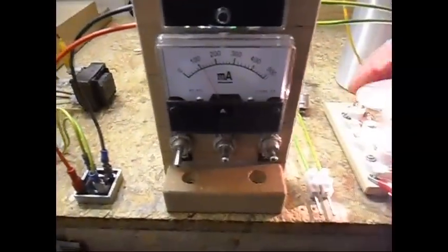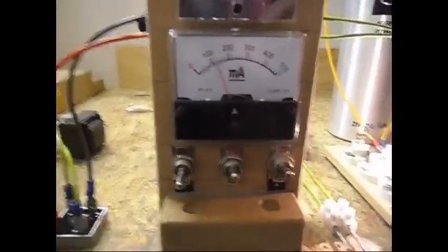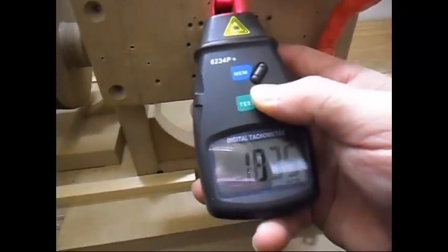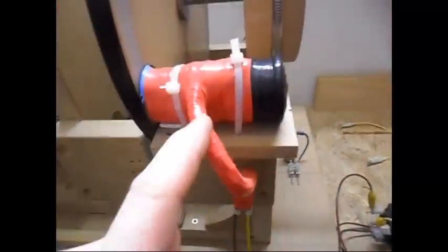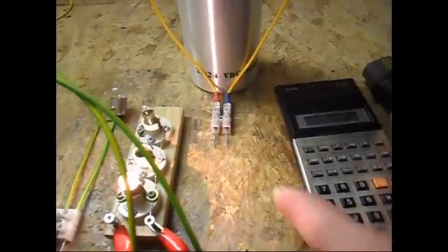So this capacitor isn't that bad, but it is best to do without it. Completely removed now — cables from the coil are going directly to the transformer. With only one light bulb, output is 8.4 volts at 120 milliamps. The output is 8.5 at 120 milliamps — that's precisely one watt. So I'm getting out of one of these coils one watt, while the system is using 29.4 volts at 1.2 amps, which is 35 watts.